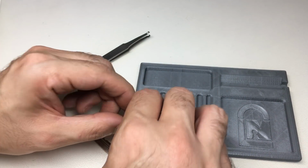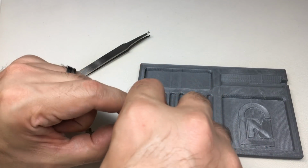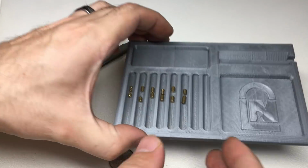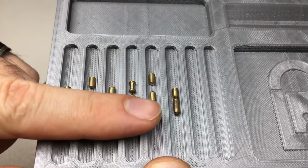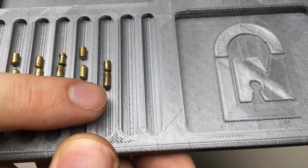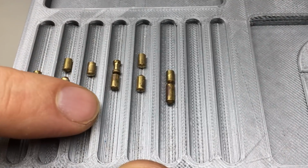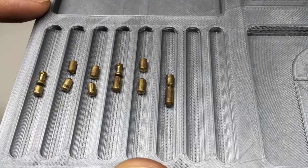I imagine, truthfully, that all these are going to be standard pins in here. I just can't imagine there being anything more. Most of these Euros will have standard pins. There we go. I won't even bother turning the right way around, and you can see them there. And look how long key pin 6 is. Look at that, really super long. But again, not amazing manufacturing on these. Look at the sort of lines and marks on the locks. Look, that sort of gouge in there. Not the nicest pins I've ever seen, that's for sure.